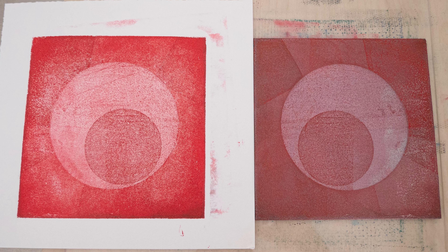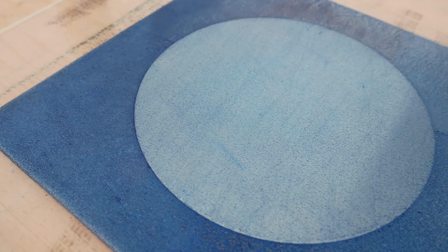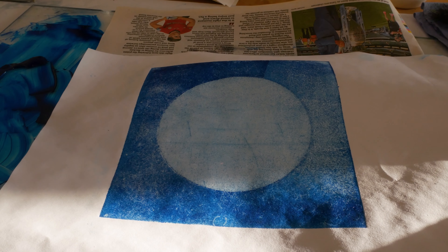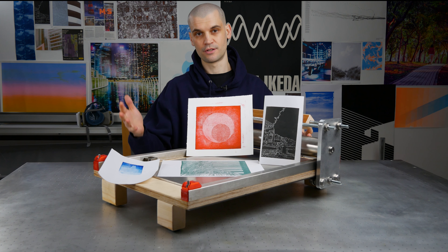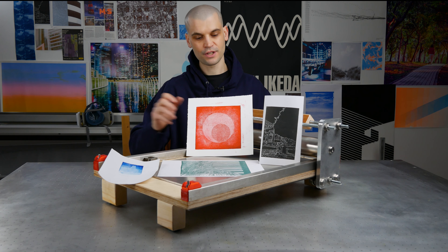For the side panels I made a jig — I'm just using some dowel pins and some Mighty Byte Pitbull clamps to clamp it in place. With this jig, all of the holes I machined were going to be in exactly the same place, which was really important because it's important that the roller is nice and level. There was a bit too much coolant here but it got the job done. Next was to place the bearings into the side panels — you can see I've got both panels made with the bearings in place. I then fitted the roller into the bearing, filing down the shoulder of the roller so it'd be a push fit.